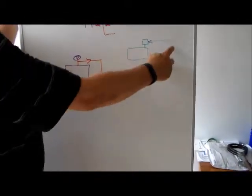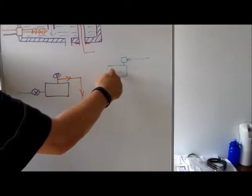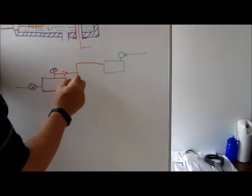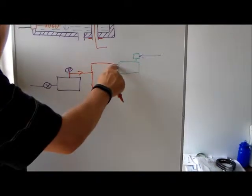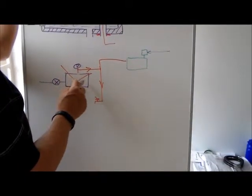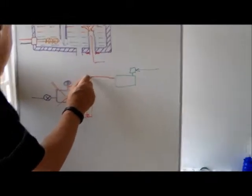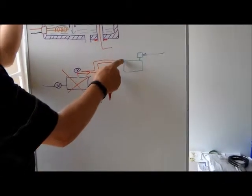Now our system is this new green one, so we've got water coming into the feeder tank, which has that float valve that will then feed water into our tank, which the collectors will heat up, and the hot water we now need to feed into the pipe that runs to the bathroom. The problem is, if we just do this, we've basically got a low pressure feed and a high pressure feed. So if I switch this off, number one, so the electricity is not going to that element, the high pressure water will always take precedent. That's number one. Number two is, in essence, we're creating a high pressure feed into this low pressure water tank, which this tank was not built to do.